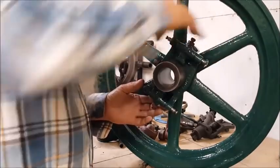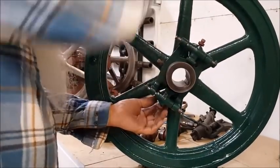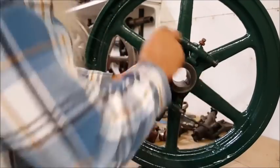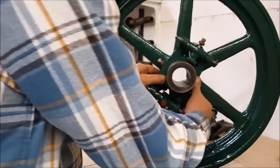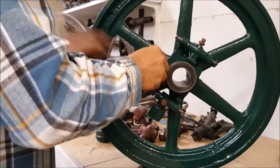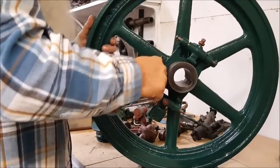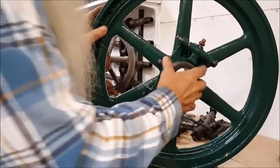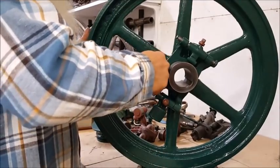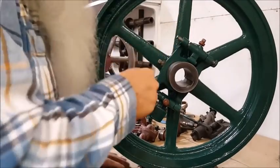Okay, what you do is you hold these weights lightly to the center of that V, if you can see it, kind of going along with me. And I'm holding the inside collar there kind of tight. So, and I won't tighten this up. Look right there. And I got some distance on that cinching up right there. Okay, I'm okay with it right where it's at. So I tightened up that pretty good, but that's a delicate item right there. So you kind of want to lay back just a little bit on tightening it too tight. Because you tend to think, you know, it needs a little more, and it probably don't. And then you lock down that lock nut right there, and that sets that all tight.